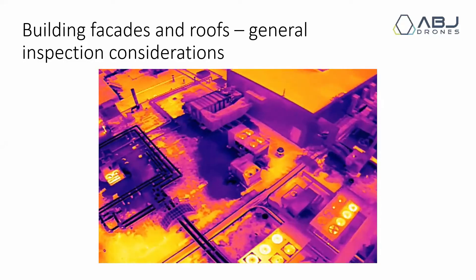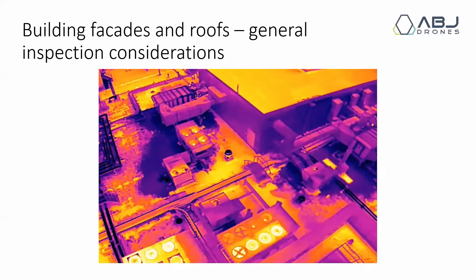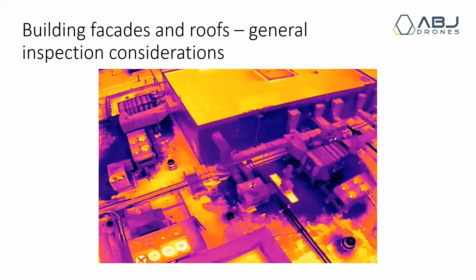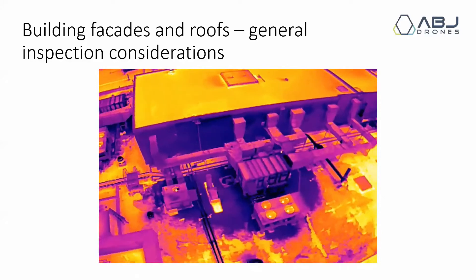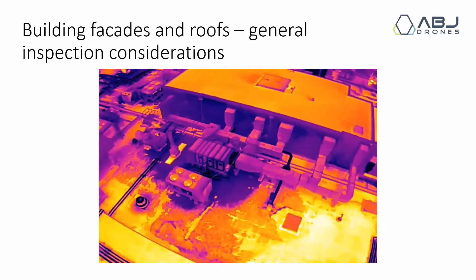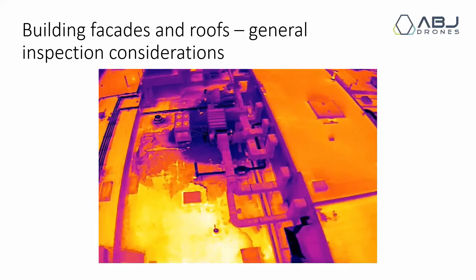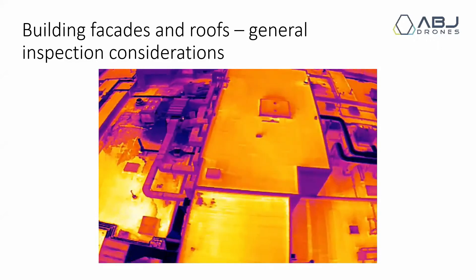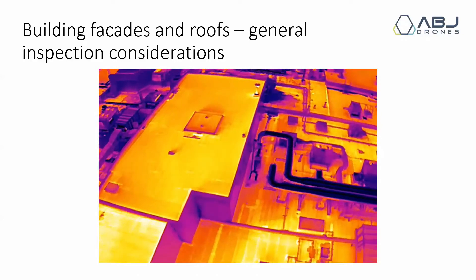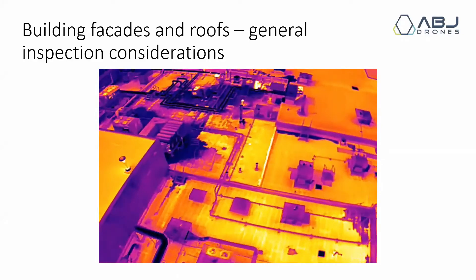One of the great benefits of drones is you can show the client immediately what the final data is going to look like. You get verification and make sure you're not wasting your time doing the entire inspection, going home, processing it, and then handing it to them only to hear you got the wrong stuff and have to fly again. You can see generally what it looks like — the wet spots, the cooler areas where there's water infiltration. It is quite noticeable in this example, though it's not always going to be as extreme. If you have any of this type of equipment, it's a very good idea to practice with it before you try to do a large inspection, so you know what you're looking at and don't give them false positives or bad data.